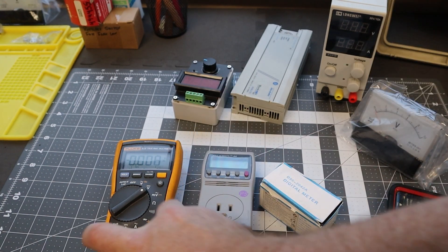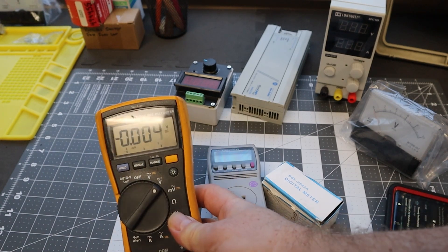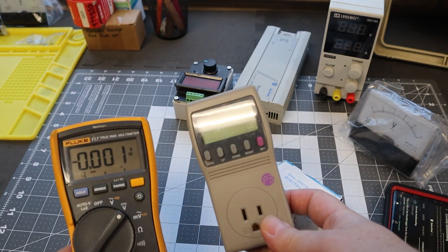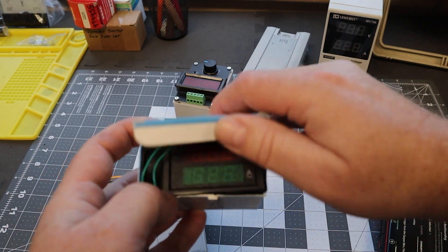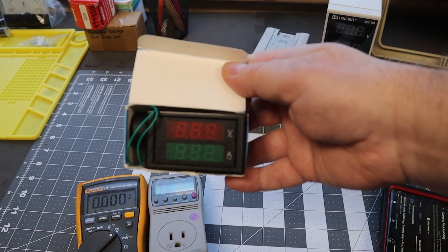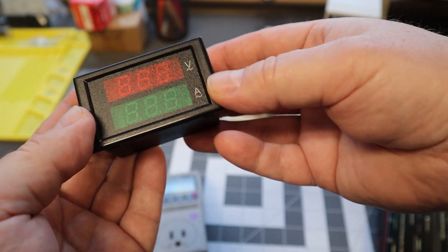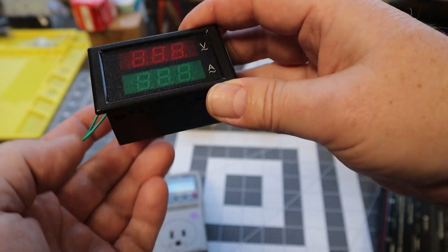If things were working too hard you'd be able to see it — if your blade was getting dull you'd have to reduce the feed or sharpen the blade so you wouldn't trip the overloads. There are ways of checking current; I have my trusty Fluke meters set up and they'll measure between zero and ten amps directly, but both have a bit of a challenge. I teach in a classroom, and if you're sitting right in the front you'll be able to see the meter okay, but these are LCDs and even backlit, nobody in the back row is actually going to be able to see them. So when Jared posted that, I thought — I've seen a bunch of these digital meters on Amazon, they're LED, they're bright enough, so if I have these in a panel mount and run an experiment everybody's going to be able to see that. The question is: are these good enough? They're really really cheap — are they accurate enough? The voltage range is between zero and 300 and the amps range is between zero and 99.9. If it's accurate within a tenth of an amp, that's good enough for the experiments I do when I'm teaching.